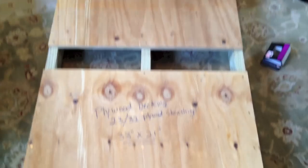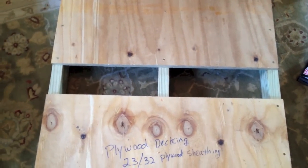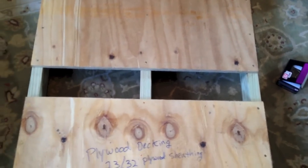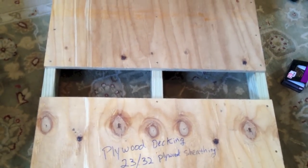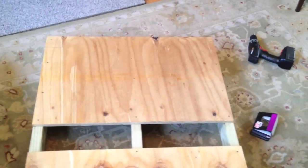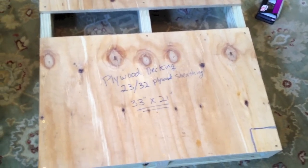Here is what the upper topside deck looks like after it's been screwed in — again, using 2-inch deck screws. You may ask why there is a space between the decking and why we didn't use one continuous piece of plywood. That space is there to avoid any kind of trash, leaves, grass clippings, or anything else that might settle in around the pallet after it's been placed, allowing it to fall out or be easily cleaned out. I've been told by folks who take their almonds to California that the folks at the border are very concerned about any kind of foreign debris coming in, and the easier it is to clean the pallets, the better off you are.